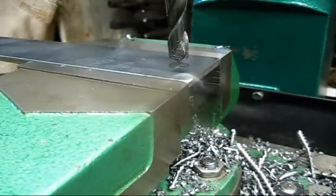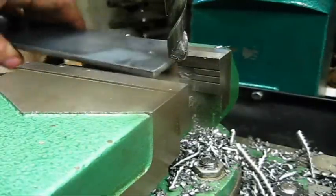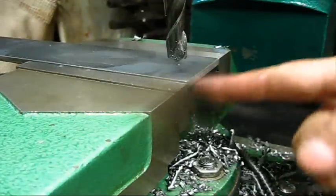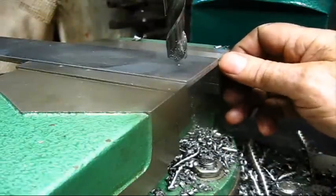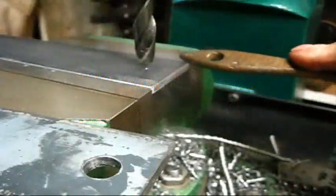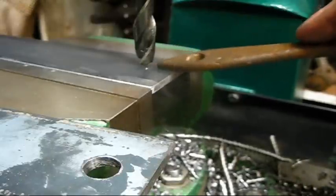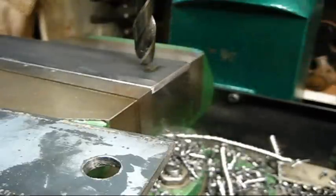In order to repeat that same hole positioning time after time, just loosen the jaw, reposition the metal, line it up with your finger. I do have two riser blocks in the jaws of the chuck to hold the piece of metal proud, but as you can see, it's even up right there, so this hole will be the same time after time. When everything is locked into position, this point on this vise always remains the same, so the hole will always be at the same position in relationship to this point.